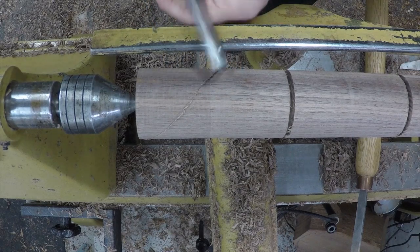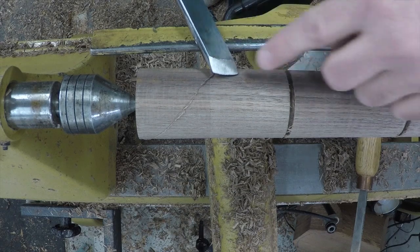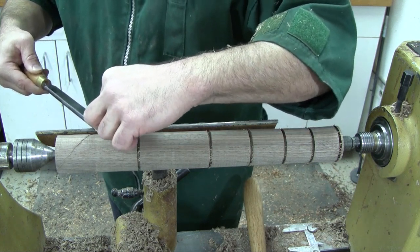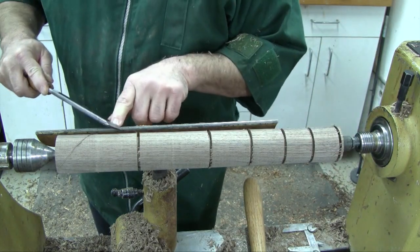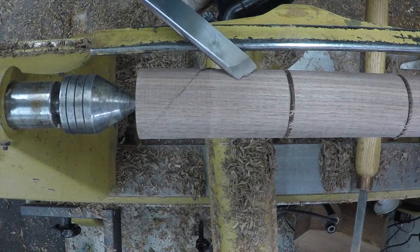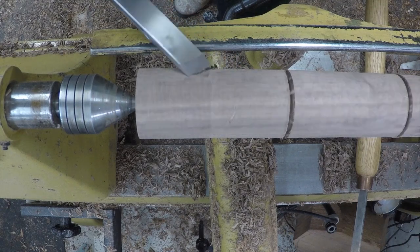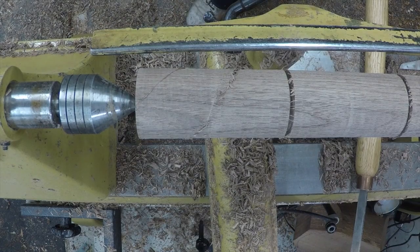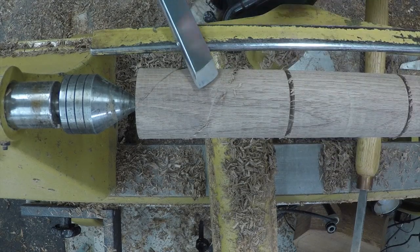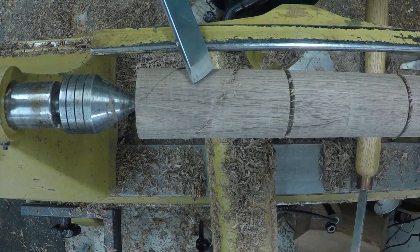If you're turning with the short point on the tool rest and you try to cut at the long point end, any little variance in the grain or momentary slip and next thing you know you've got that pressure pushing the tool down into the work and you get that infamous spiral. Now if I turn the tool over, everything is reversed — my fulcrum is on the long point. If I press on the long point end I feel nothing, but pressing on the opposite end I start to feel twist. So if I have the long point on the tool rest and cut with the short point end, I have the same problem — a slip means downward pressure digs the edge in and we get another spiral. A lot of turners refer to cutting at the supported end as the sweet spot, and that's exactly why — it's very easy to control because you don't have that leverage pushing the tool into the work.